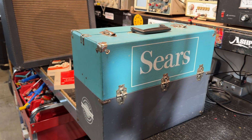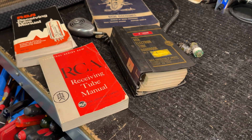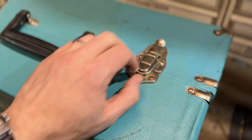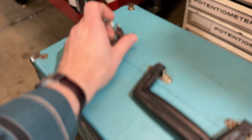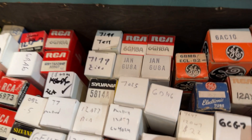Today there really isn't much substitution, but we have an issue with the 7199 tube. Being that it's become so costly, we have generally substituted with something. There are some options, but there are no direct subs for this tube. You can get an adapter or you can rewire the socket, and we're going to do that now with this Ampeg. The reason we're not using the adapter is that the tube shield housing is just a little too small to fit it. So we're going to rewire the socket. The two tubes we can use for substitution are the 6U8 and the 6GH8.